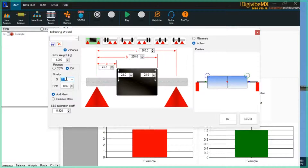After specifying the G rating you're trying to achieve, you also specify the nominal operating speed of the rotor. The balancing machine is not going to be capable of spinning a rotor at 17,000, 18,000, or 100,000 CPM — but that doesn't really matter. What matters is that when you set up this job, you specify the normal operating speed of the rotor in use. So if you're doing a turbo rotor that turns at 100,000 CPM, you put 100,000 CPM here. Whatever the normal operating speed of the rotor is, that's what goes in this block.